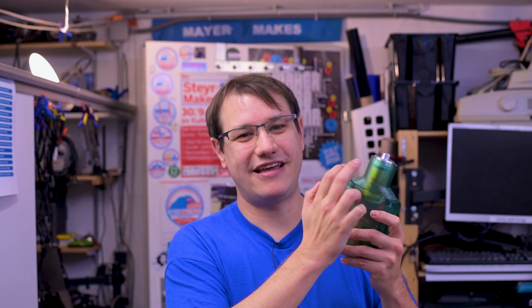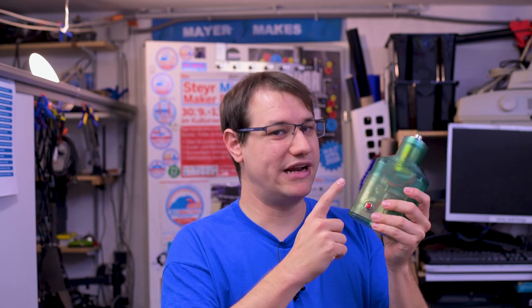Too late in the process, I looked at designs that other people have made in the beekeeping community, and it turns out they all use a lot higher voltage and a lot less thermal mass. So usually 18 volt to 24 volt systems, lawnmower batteries basically, and they all use a lot less aluminium block, like a lot smaller designs. So this is basically too much thermal mass for too little power.